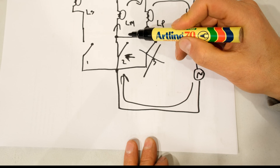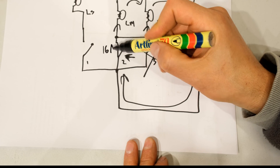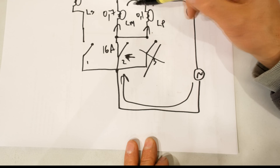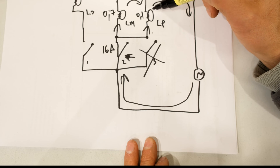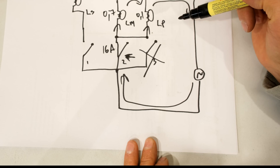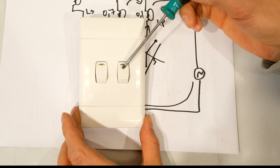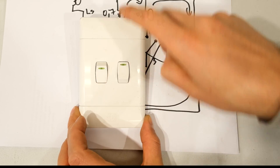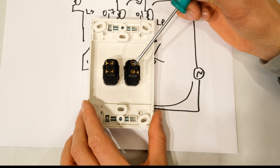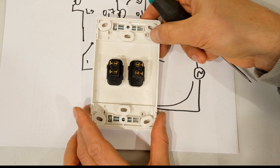The point of the video was to show you that you can use one switch to control two circuits. If you are going to use one switch to control two circuits, make sure you do not exceed the rating of the switch. For example, this switch is 16 amps and the loads are well below one amp each - these are LED tubes and a small LED light, so I'm well within the 16-amp maximum. If your switch has two terminals, all you do is take the wire from one terminal and join it to the wire on the other, and one switch will control both circuits. Thanks for watching, cheers.